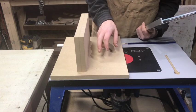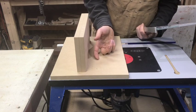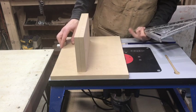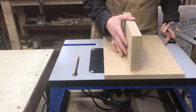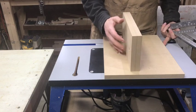As you're screwing this in, you want to make sure this is staying square. So as you put one in, make sure it's still square and check it for each of them. If it gets knocked out of square, the options are either re-drilling or using back braces to force it forward or backwards. Conversely, either pull it backwards or go forwards.